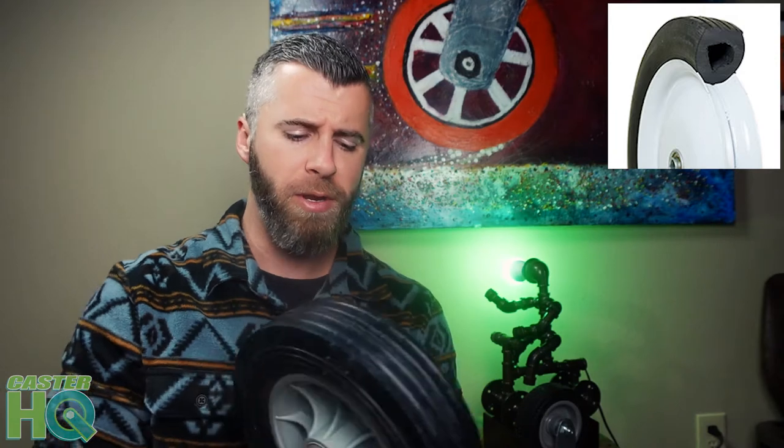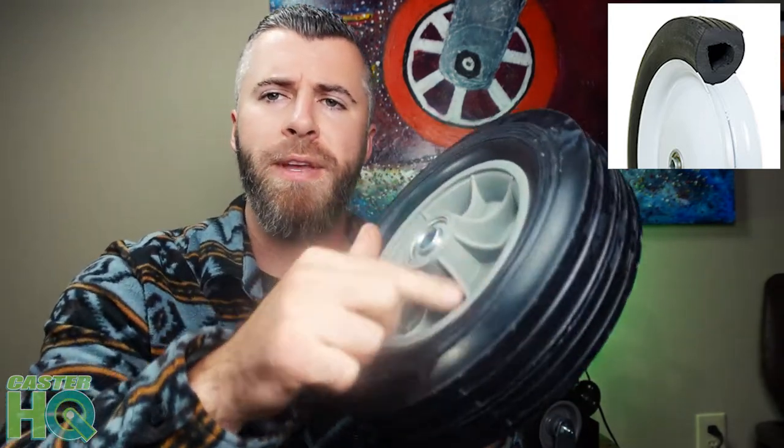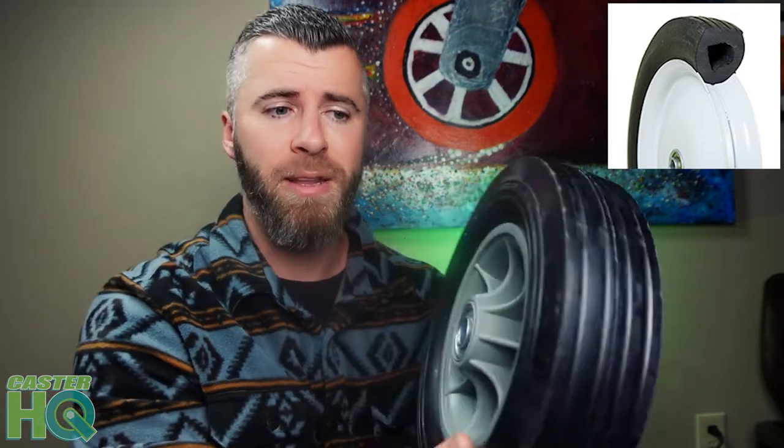The air pocket is really neat because it allows the tire to flex a little bit as you're rolling it. The semi-pneumatic is my favorite — it's a very heavy wheel, so you know you're getting really good quality. The core is an industrial polyolefin, which is plastic but very heavy duty. I've actually never seen this plastic hub fail; I've seen more metal or steel hubs fail before these heavy duty plastic hubs. It's not going to rust, it has a very thick rubber tread with that air pocket in the middle giving it flex. You never need to maintain this tire because it's flat free.